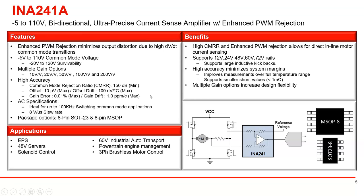We spec switching applications with AC CMRR at 100 kilohertz, which is about 104 dB — that information can be found in the datasheet. The slew rate on these devices is 8 volts per microsecond, making them quite quick and very good for large inductive kickbacks or high dV/dt applications.